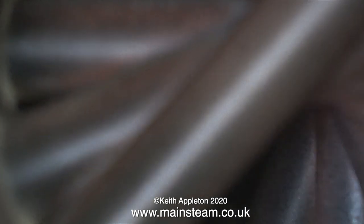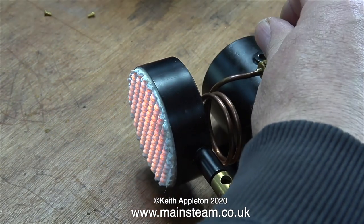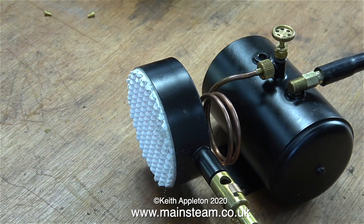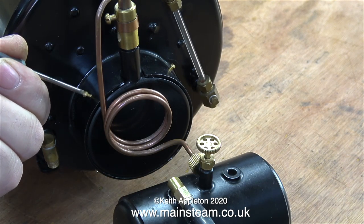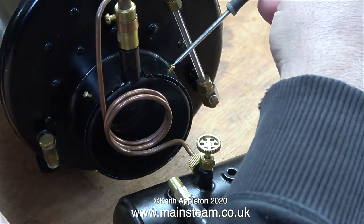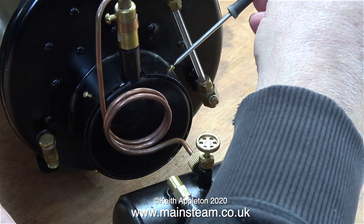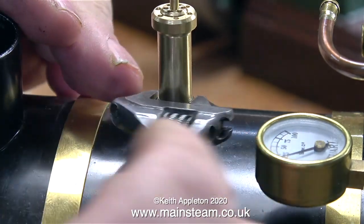While on the subject of heat, this is the heater that fits into the end of the boiler. As you can see, it's a large ceramic type burner. The good thing about this ceramic burner is that it has the correct type of ceramic — some ceramic burners these days use a different kind and it's not very good; they do tend to overheat. I had many discussions with Mike Abbott from Mac Steam regarding the problems with ceramic burners generally, and we both came to the conclusion that this type of ceramic is the best to use if you can get it.